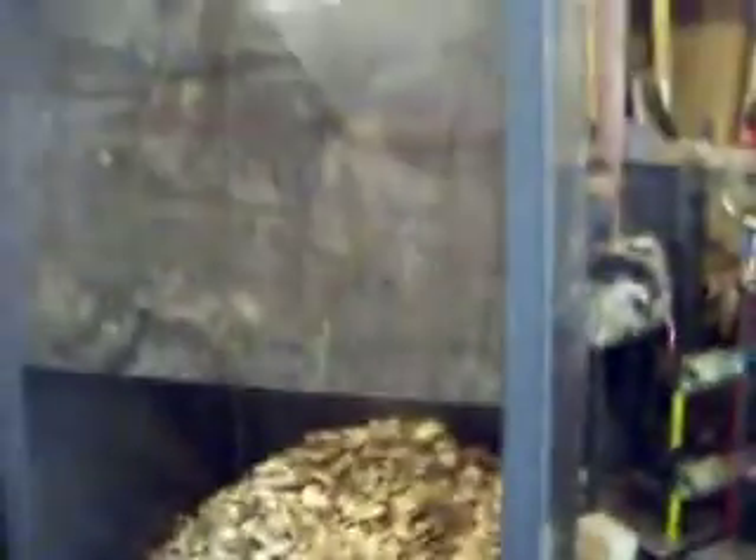Good morning everybody. This is a drive mechanism for an auger that runs a gasifier. This is a DC motor, not an AC. There's a small reduction here — this is a 100 to 1 reduction unit, lovejoy coupler, and flange bearing. Up here are the wood chips. The entire assembly has a plastic window, it's a bit dirty, so you can kind of see what's going on. I've got it tipped a little bit because it won't quite fit on the temporary gasifier that it's running.